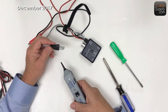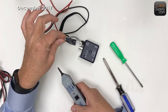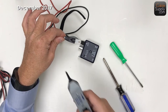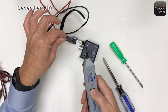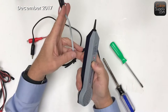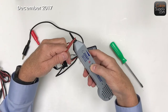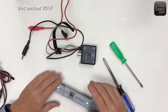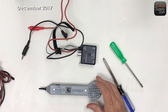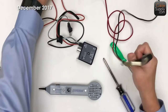This is an RJ45, so you plug this into your outlet in the office or in the room, and then you go back to where your cables are hanging down and you can actually find the cable - it will actually come across the cable. Sometimes, especially when you're dealing with Category 6 cables and you're trying to tone those out, the tone doesn't come through very clear.